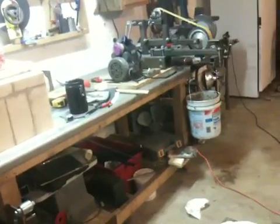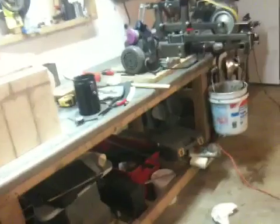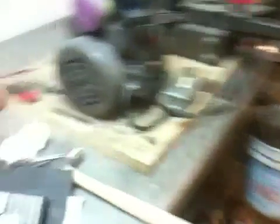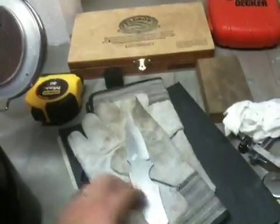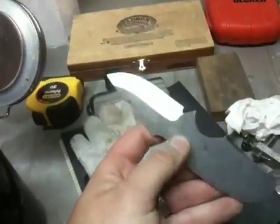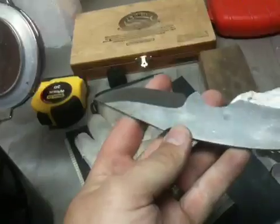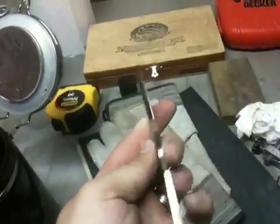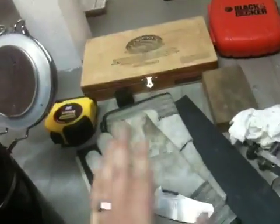The first thing I do is get my knife prepped for heat treating — that's simply to rough profile the blade out, get the blade grind done, and then drill any lanyard holes or holes for the handle and get that all out of the way. I also like to take the factory finish off just to reduce any scaling as much as possible. This knife is almost ready for heat treat — I'll go over that in more detail as I continue through my process.